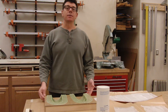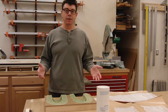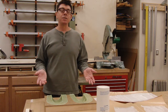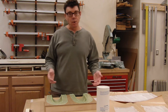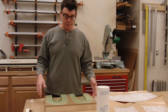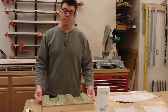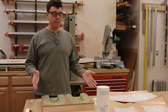One of the things that's important is we need to make both halves simultaneously. We don't want to make one half, mix more epoxy, and make the second half, because we need the two halves to reach the leather stage at the same time. Also, dealing with the mold can be difficult because they tend to rock and move around. So I've made another version, slightly larger than what we did for the parting board, to hold both of them at the same time, so they're easier to work with. So we're ready to get started.